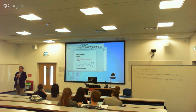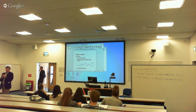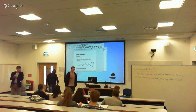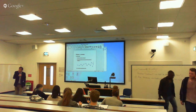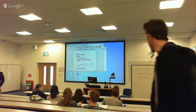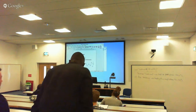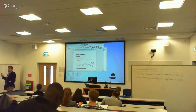Okay. All copper alloys are good in corrosion resistance. All copper alloys are quite heavy. They are heavier than steel. Why? Because copper has a high density. Again, special properties of copper alloys: good corrosion resistance, good aesthetics. They look nice. There are a lot of applications. Very good electrical conductivity and heat conductivity.